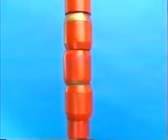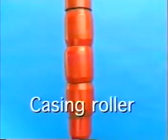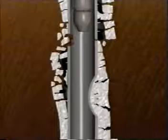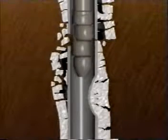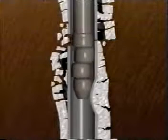If the well operator finds the casing problem is more severe, such as collapsed or parted casing, more aggressive measures must be undertaken. With slightly collapsed casing, the common tool used is a casing roller. In this procedure, a set of hydraulic jars, bumper jars, and drill collars are run above the roller. When the desired depth is reached, right-hand rotation and the eccentric action of the roller will return the casing to its original shape and ID.